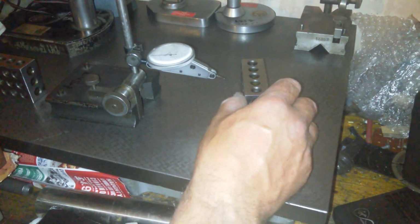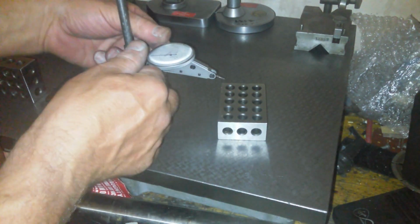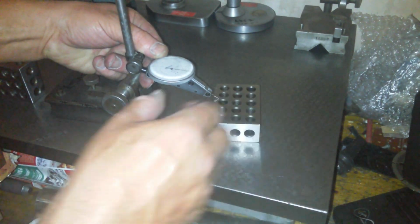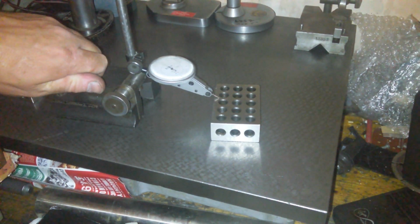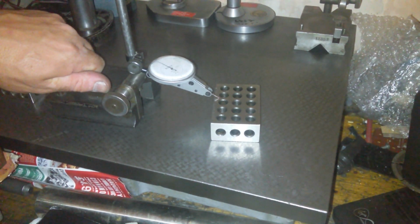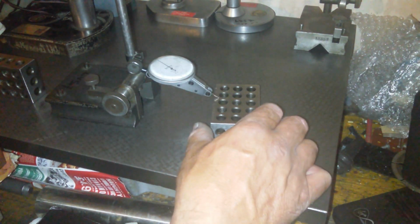That's perfect. I can't believe that. That's just unbelievable. There's no chance all the sides can be perfect now. There's 1.5 thou in them yesterday. This is the side that was the worst on both of them. So let's get it in. So there is, okay. One thou preload.